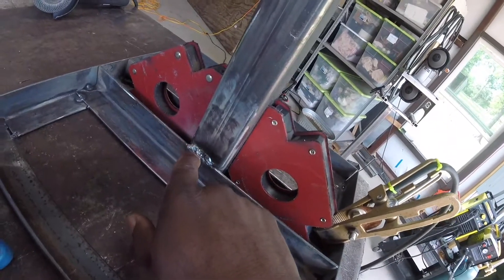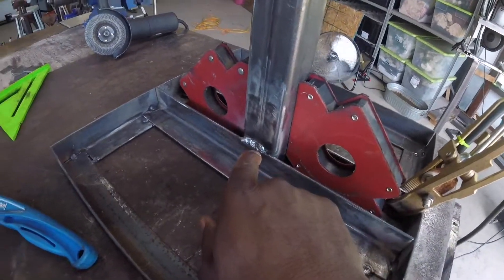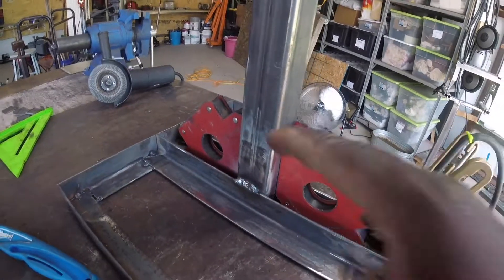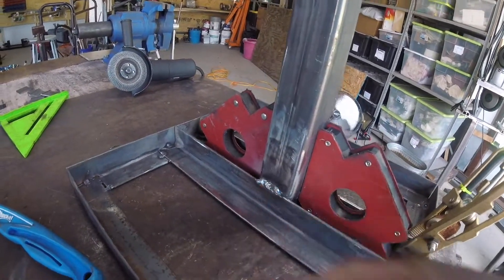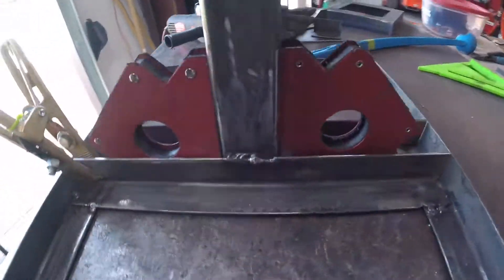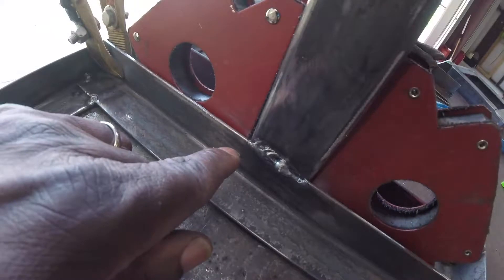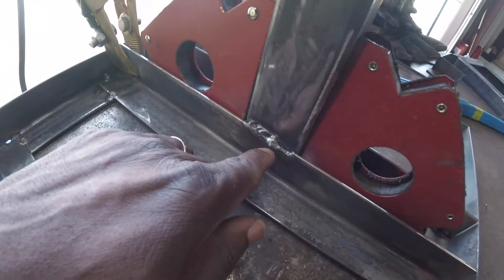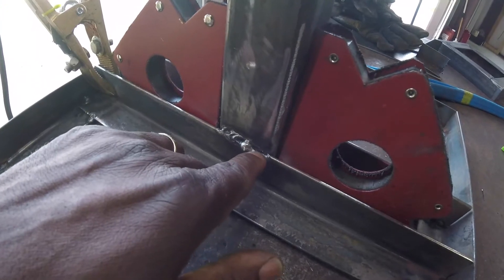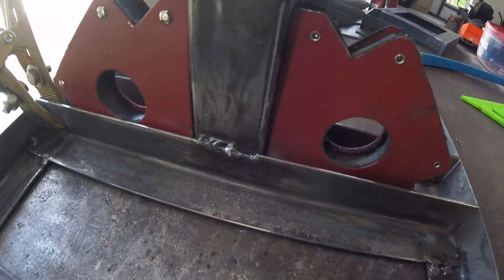As you can see it's level, and I ran the bead on both sides. The welds are ugly but the good thing about the 6011 is it's a deep penetration rod and it drops a lot of filler. I can see the undercutting, so I know it penetrated enough to hold it. I'm going to flip it over and put something in the back. This one here was going pretty good and then I slowed down too much and got a big glob there — I'm probably just going to tack a little bit right there and that'll be it.